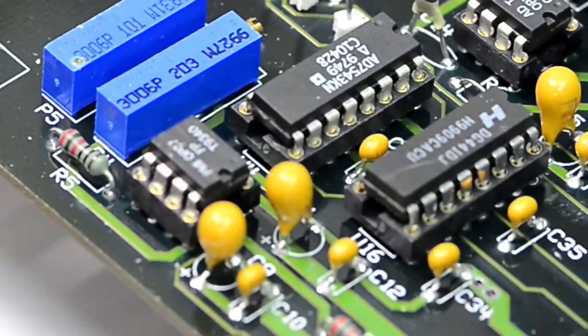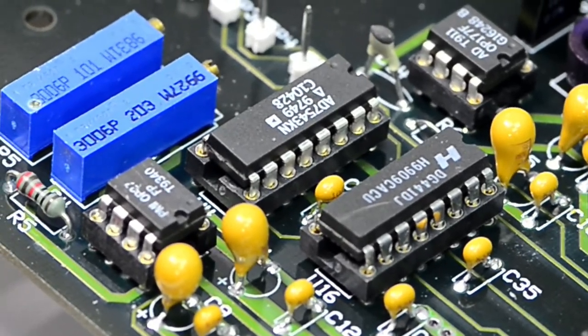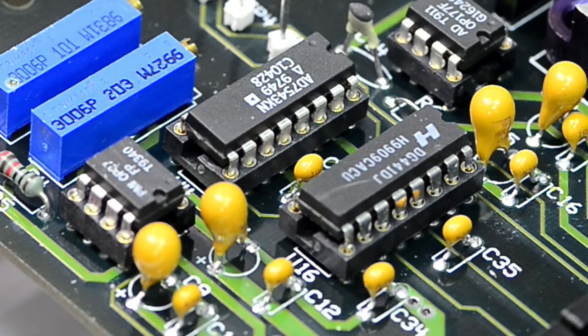All right. So another closer look. That's the AD7543, another expensive chip. It's next to the switch. It's used to program the current. Because you essentially set any current you want from 0.1 milliamps, or actually even lower than that if you want to, up to 250 milliamps, and then the bridge will do all the magic from your desired current.